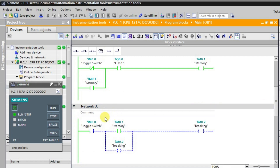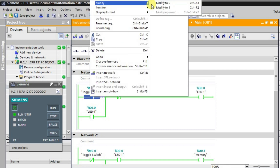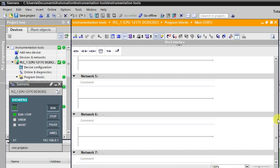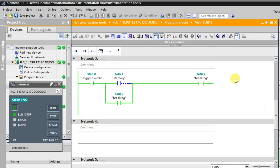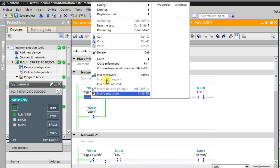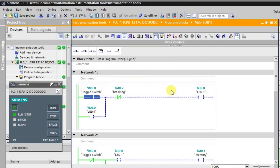Now when pressing the toggle switch for the second time, the memory bit is in the high state, so power flows through to the breaking circuit and it activates. Once the breaking output activates, the output automatically goes to the low state. We can observe the output goes low and the status is updated accordingly. After releasing, everything returns to the normal state. In this way we have created the toggle logic without using any counter or compare instruction — this is one of the typical PLC logics.